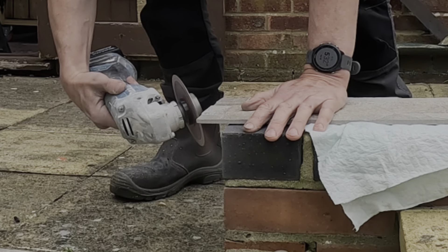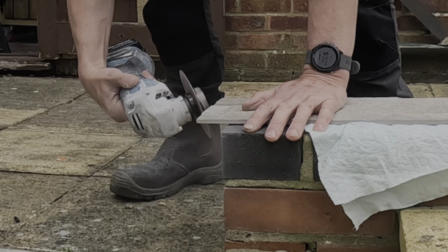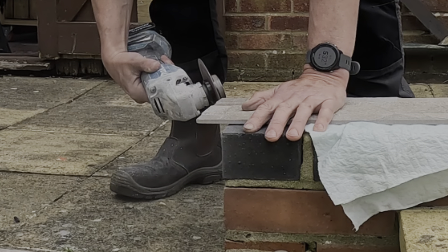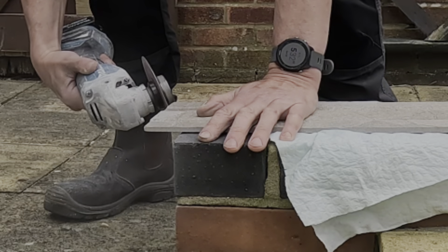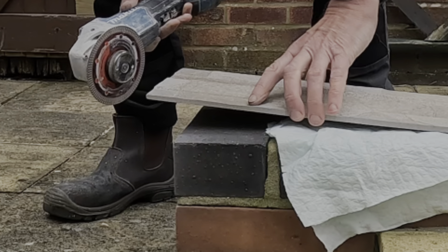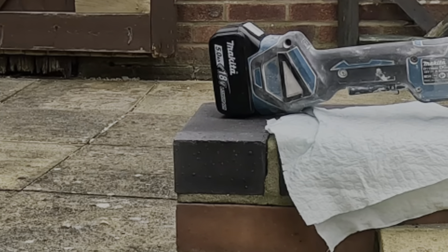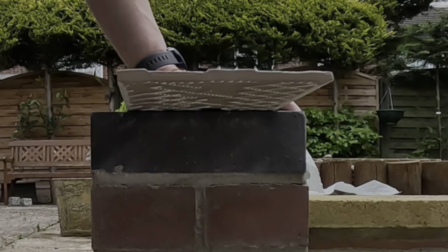I'm cutting the tiles with a diamond blade. Now I'm cleaning the edge — I've cut it at a slight 45-degree mitre, and I'm cleaning that edge off with the grinder. It creates a sort of weak edge and then you can use the diamond hand pad to sand it back. These are porcelain, remember — you create a weakness and a thinner amount of tile, it's just easier to sand back.